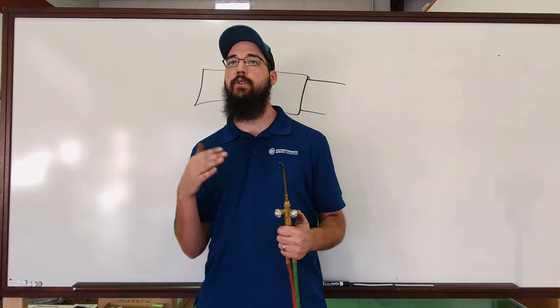A thing I'll warn you about: if you're using the brazing rod as your temperature test, putting the rod in the flame doesn't prove temperature. If you're going to use it for a test, pull your flame away and run your rod across it and see if it changes, tries to melt, or softens. That's more of an oxidizing or ionizing flame — you'll want to increase on your acetylene a little bit. You see that feather come out? That feather is what you're looking for. Get a little bit more feather on it. Right about there — that's going to be a good reducing flame.